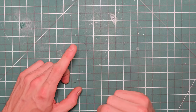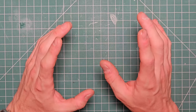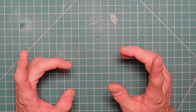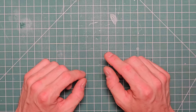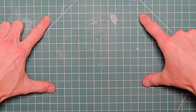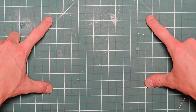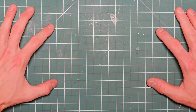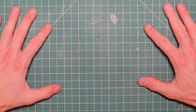To backtrack slightly, if you don't know what rolling shutter is, check out the link in the description where Destin from Smarter Every Day does a great job going through what rolling shutter is and covers global shutter as well. The long and short of it is that a global shutter reads all pixels at once. A normal rolling shutter, as you get in most phone cameras, reads pixels one at a time, and global shutters do this by storing an analog buffered read of the data.